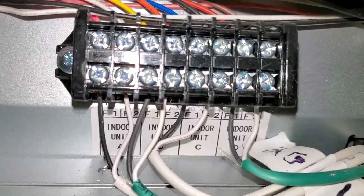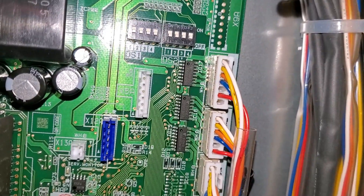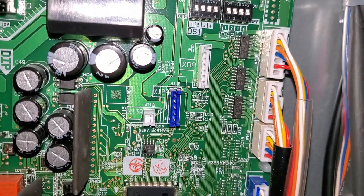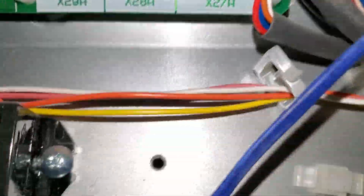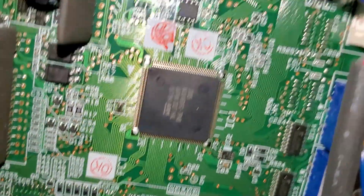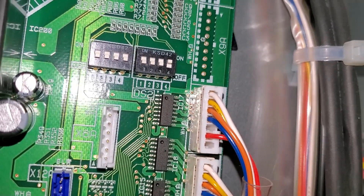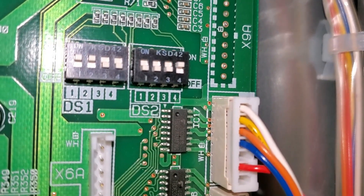Using wire nuts for communication is never a good idea, so the technician soldered the splice together properly so we wouldn't have issues later. When setting dip switches, always refer to the chart on the inside of the branch box panel — it will guide you through which switches to turn on. Most of the time we only set DS1 switches on for the ports we are not using. For a 6- or 10-port box, check that DS2 switch four is on, which disables those two internally non-existent ports on the board.